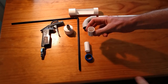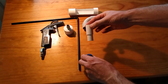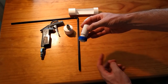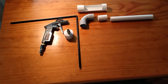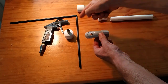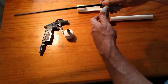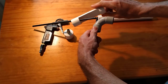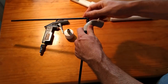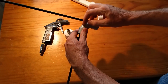Let's start by taking this coupler and this piece of 15mm PVC pipe and press fitting them together until it goes all the way down. I'm going to take this bottle cap that I've drilled a hole into and hot glue it onto that end. Next, we insert this tube into this elbow. I'll show later in the video how I drilled a hole down through the centre for this tube to enter. It's as simple as feeding it down into that hole and setting the depth of that tube against this pipe. Then I'll hot glue it into that hole so that I don't get air and powder escaping up through this joint.